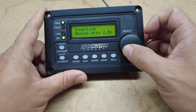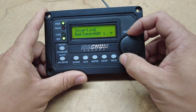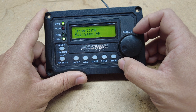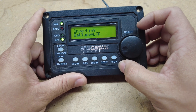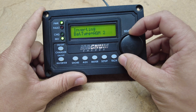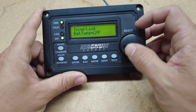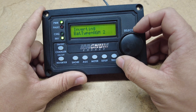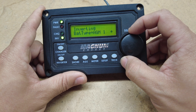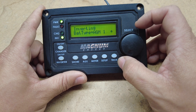We have absorb time — absorb hours is two and a half. We have battery type: AGM one, AGM two, CCCV custom, and that's lithium iron phosphate. This remote can be changed to the lithium setting, which is LFP. It also has flooded and gel. The difference between AGM one and AGM two is I believe just a half a volt difference, and it matters which manufacturer made the battery — so be careful when choosing those two. Always look at your manual to see what you have.